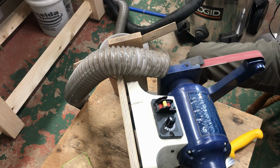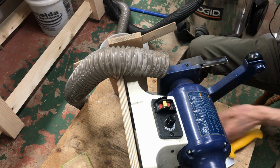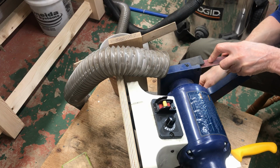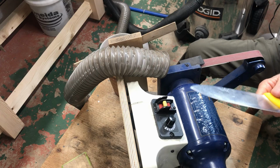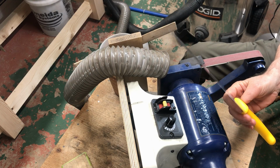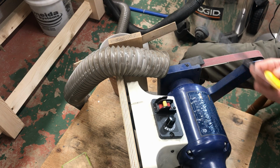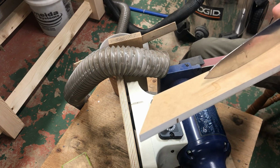So now we're finished with the major grinding, and we are moving on to a Cubitron 120. Not much work to be done here. Mainly we are just going to refine the scratch pattern, try and reduce the burr just a little bit. I'm also going to cut in a secondary bevel, probably around about 5 degrees, I'd say. This is just to get the performance of the knife back up to what it should be.